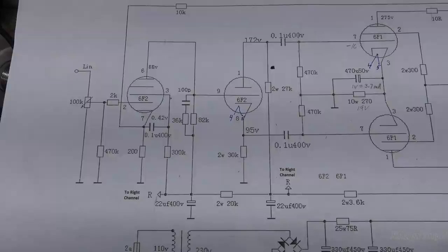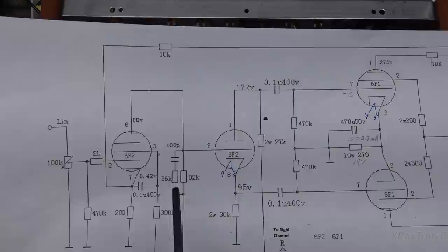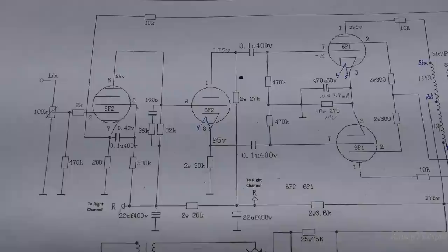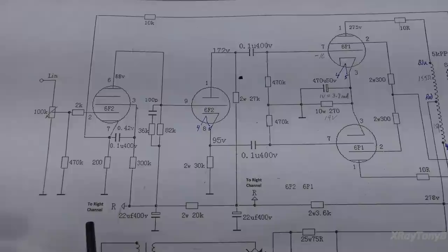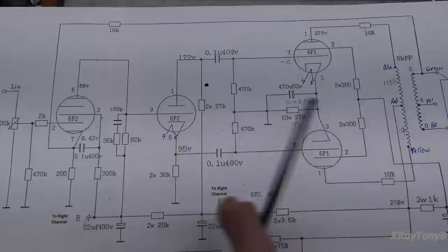Another thing I want to mention — I got a couple of emails from some of my patrons and some comments, not just in this series but on other amplifier videos I did in the past with vacuum tubes. A pretty common question is: I got one of these kit amplifiers, or I rebuilt an amplifier, and when I turned it on I got this horrid sounding screech — really loud on the speakers and I had to turn it off. Most of the time what causes that problem is the way you have the output transformer wired.